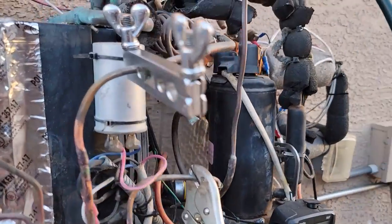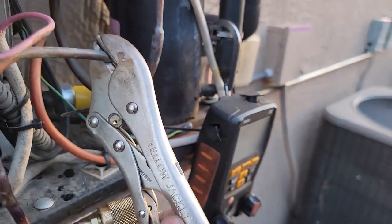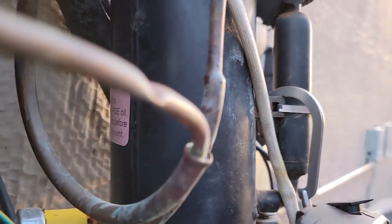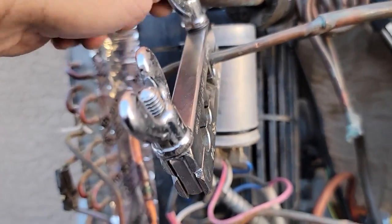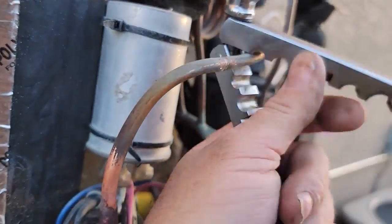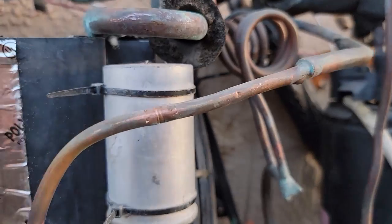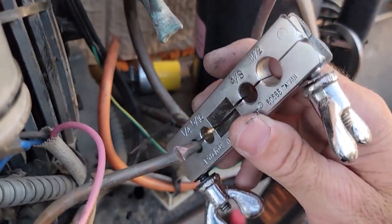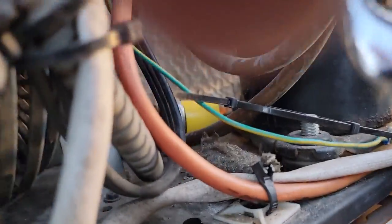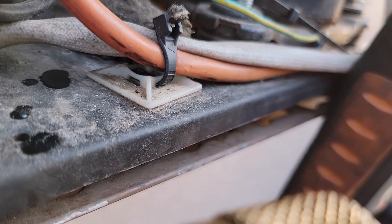Might as well show how I do this. You have this crimp point here — people think it looks bad. But when you put the tool on there, crimp it and round it out a little bit, it comes out pretty good. It's got a scar on it, but that pipe is round. And looking here — that's definitely flat from a pinch-off tool.